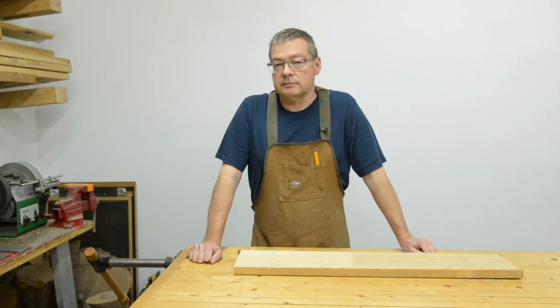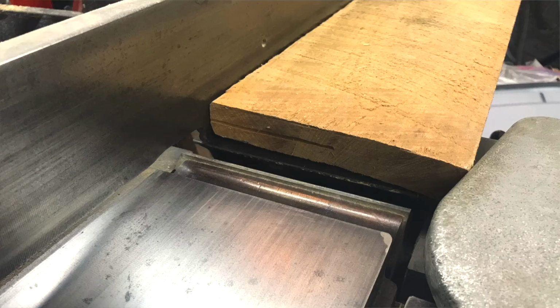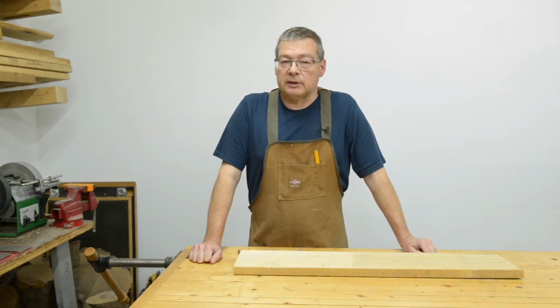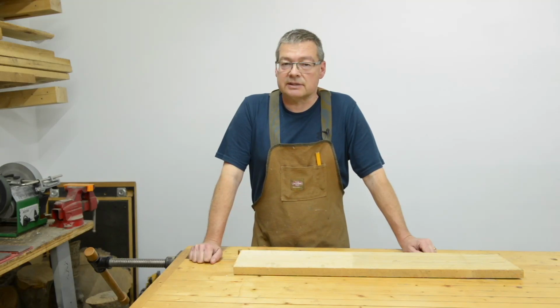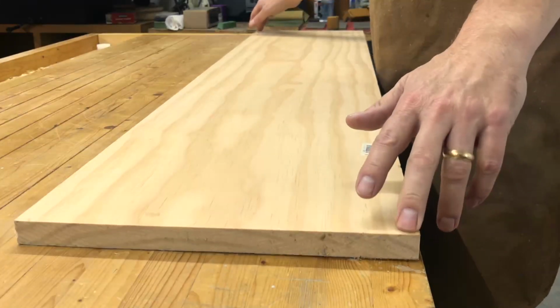I often work with boards much wider than my 6-inch jointer can accommodate. In that case, I'll joint one face flat with hand planes, take it to my thickness planer to get two parallel faces, and then I'll finish the milling process with my jointer and planer. For me, if I'm working on my own, I generally just use a completely hand tool process because I just enjoy the quiet solitude and not having to deal with airborne dust or the noise associated with machinery. We can also use hand planing to touch up dimensional lumber that's developed cup, twist, or bow after dimensioning.